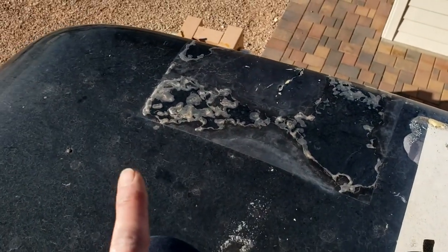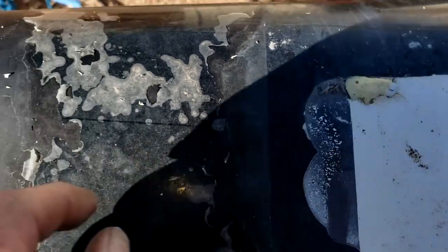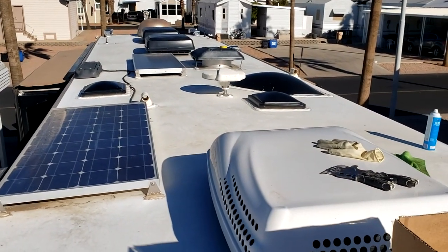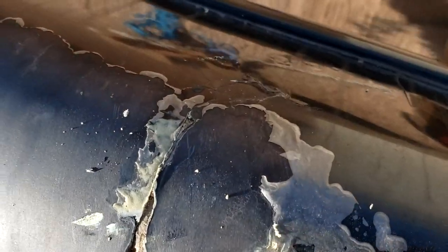The obvious repair would be to grind this all out, do a fiberglass repair, and then repaint it. Or we're just going to go ahead and use some ProFlex over the top and seal off these areas. You can see a little bit of damage right there too, and you can see the actual fiberglass — that's why I say these are true coat fiberglass. All I'm going to do is chip off any sealant that's on there and put some clear ProFlex over the top so it's at least watertight to keep water from getting into the roof.